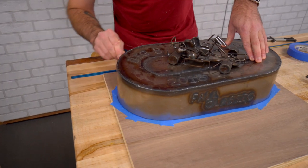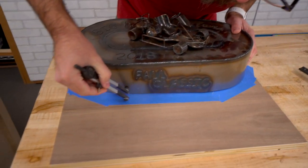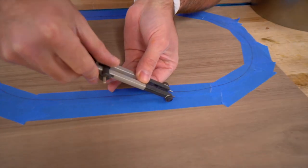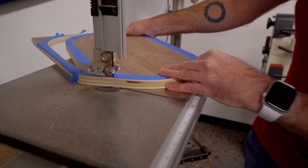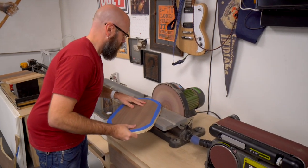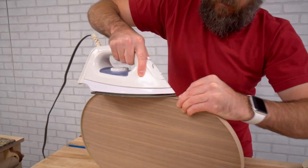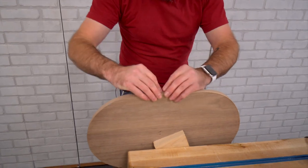I traced my line on here and now I'm going to expand on that line using a compass. You might wonder why I didn't use a compass directly against the piece — that's because I can't get in there since these little nubs get in the way. I laid tape down so this plywood doesn't tear out when I cut it on the bandsaw, and I'm going to cut through both pieces where we have this seam.